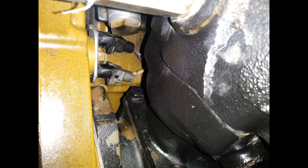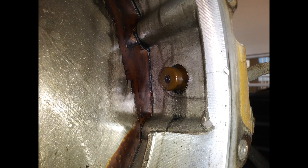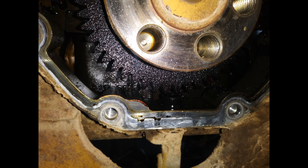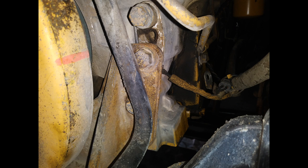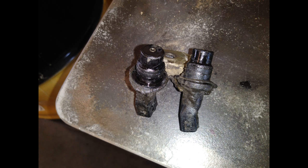We had checked everything — fuel pressure, HEUI pressure, no check engine lights. It was seeing an RPM signal but wouldn't start. The timing sensors on this 3126 CAT are not easy to get to; they're behind the air compressor. Here we have a C15 — you can see the cam gear timing sensor and an inside view with the cam gear removed. We also have a C12 with the crank position sensor on the bottom, and a C15 crank position sensor in the front structure. This was the wiring going to the timing sensor on the 3126 I couldn't start, and I'd seen that the wires were bare. The customer also thought it was a HEUI pump because they had replaced the HEUI pump driver and that would fix it for a little bit, so I decided to put a new harness on it.